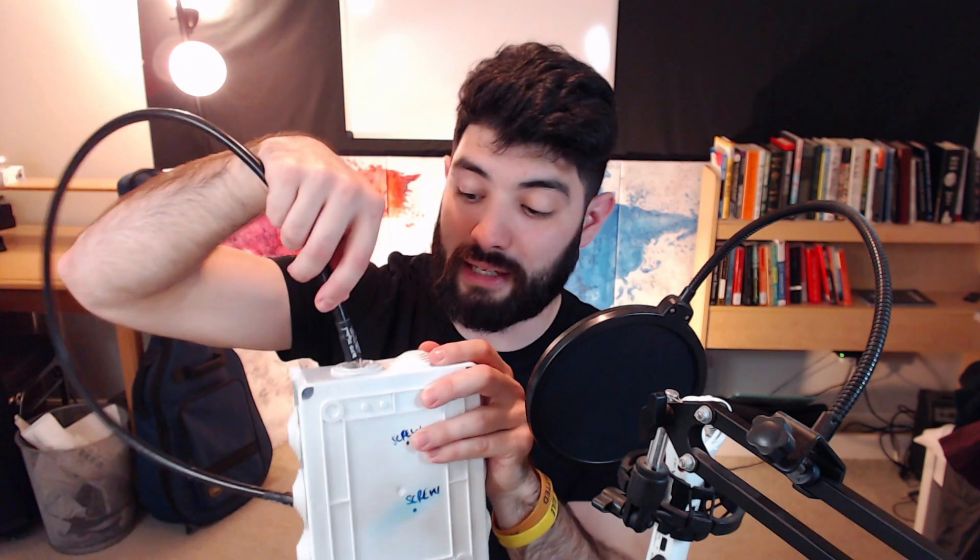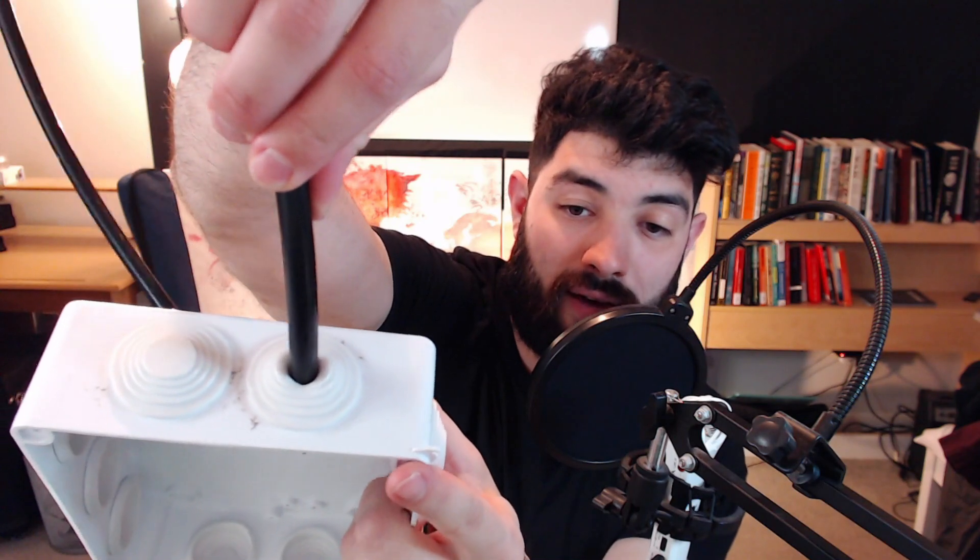The enclosure has these little rubber gasket pieces. I make a little cross and cut right through, or you can cut one of the sections off — though it is slightly big, so be careful. Personally, I just cut a little slice right in the middle. I slide the ethernet first — super important — slide ethernet first and then slide in the LMR 400 cable. Once you get it through, just push it all the way. You don't need to cut off everything.